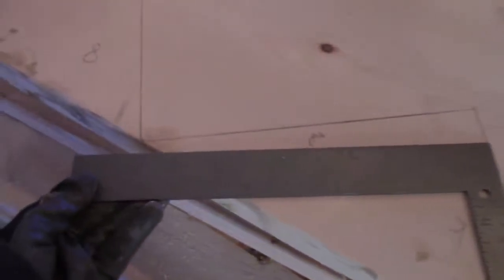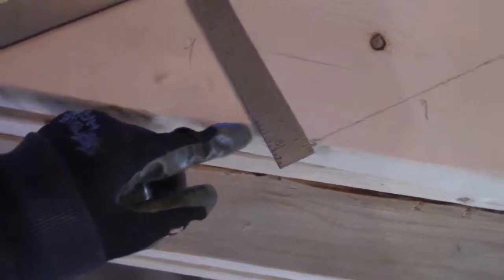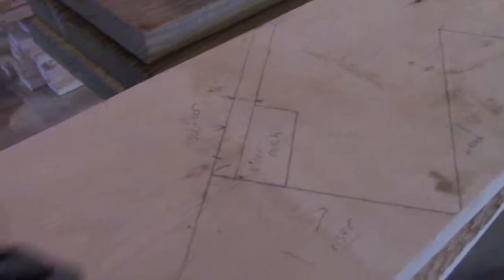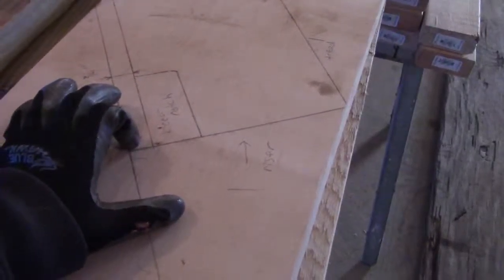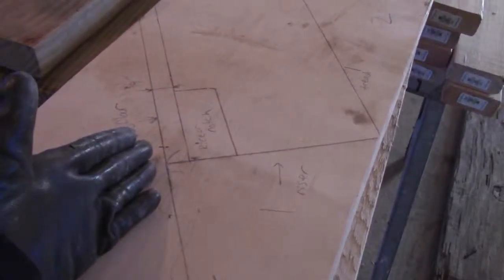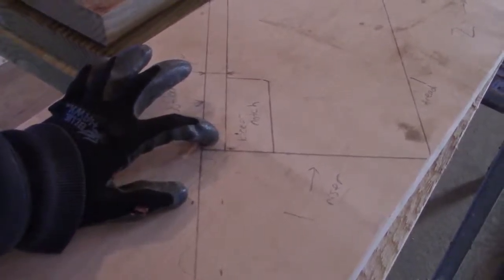And for this, it happens to be 10 inches for a tread and 7 3/4 inches for a riser. So you can see those are 7 3/4, those are 10. And basically did that the whole way up here, marking out rise and run, and with a couple of modifications. One is that for this first tread, if you will, we already have a tread in place, which is the subfloor, basically, and we're not going to put this underneath the subfloor. It rests on top of it, so we need to cut this one shorter by 3/4 inch,